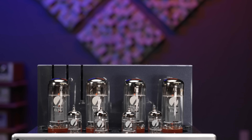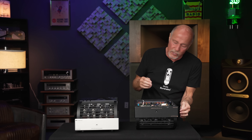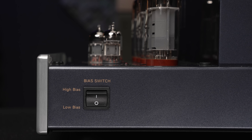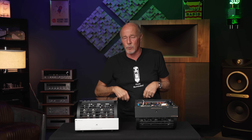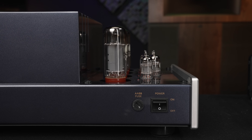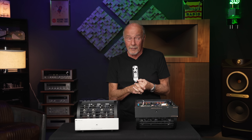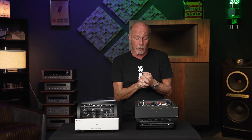The entire signal path is point-to-point wired — that's the way to do it. You'll see ten-thousand-dollar amplifiers where tubes are mounted to a printed circuit board. The problem with that is wiggling the tube flexes the board, and when the board gets old and brittle it can break the traces. We wanted to build something that people can own for a lifetime, and they do. PrimaLuna products maintain their value because of it — the stuff made in 2003 is still working today and has become collectible.